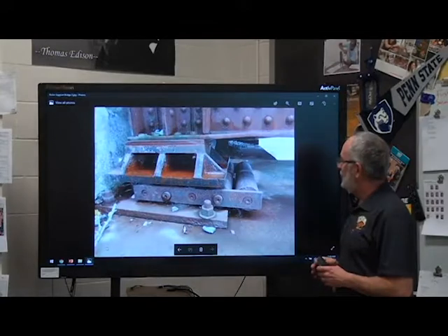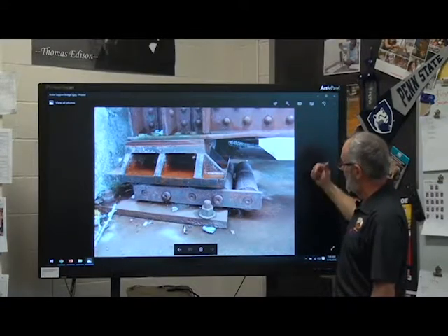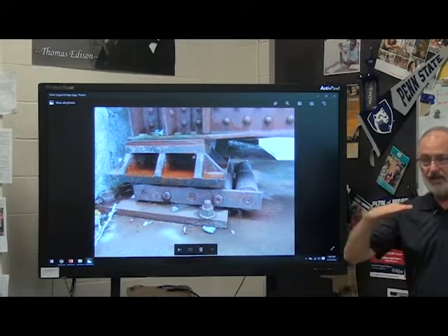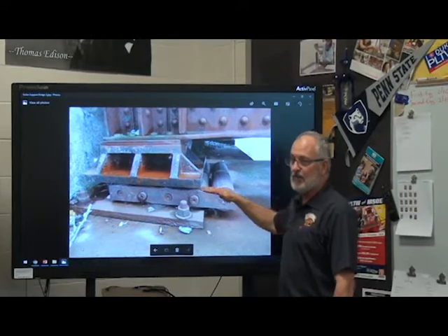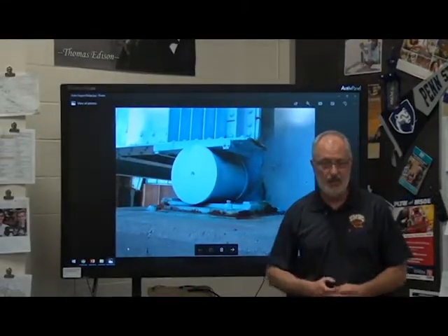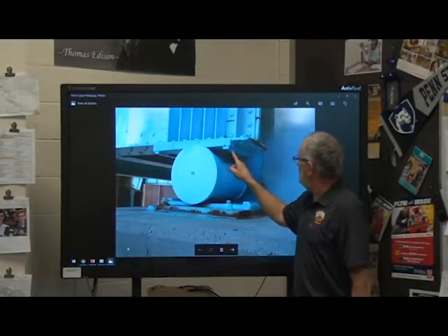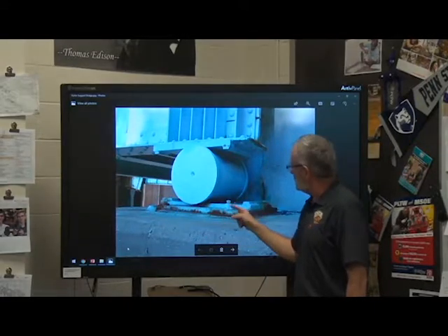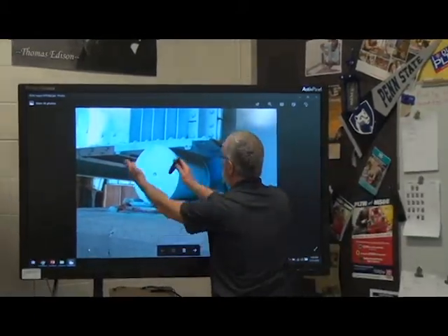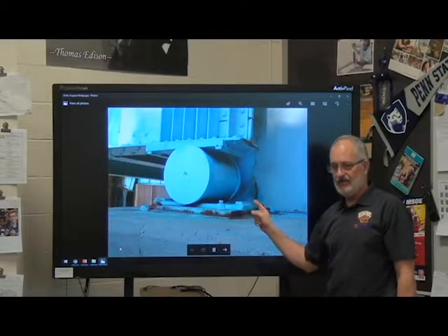Let's get a better, close-up picture. We have a bridge supporting automobiles or a train. The bridge is sitting on this pad, which is resting on one, two, three, four — it looks like five rollers. So that bridge is able to move back and forth in this direction without resistance somewhat. Here's a really good one. You have a bridge sitting on this big roller. At the end of each plate, there are welded-on steel bars so that roller can't just roll infinitely — it will come to a stop. But there is a fair amount of movement that bridge can go back and forth on. That's a roller support, and it's going to come in very prominently in our truss calculations.